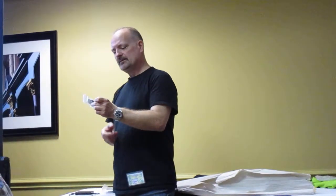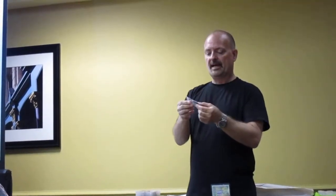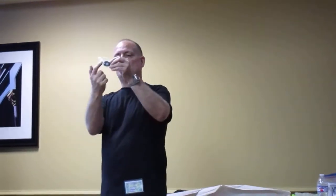This piece here, I would use balsa wood or pine or something like that. And you guys may have better wood that you like better. The best way to do this, if you have no wood routers, you just have hand tools, is just carve it out. Make a pattern out of styrene. Styrene holds up and you can keep using it. If you make it out of paper, it's kind of a one-shot deal because it's going to get all messed up. But you just want to make sure that you get that shape that you want.